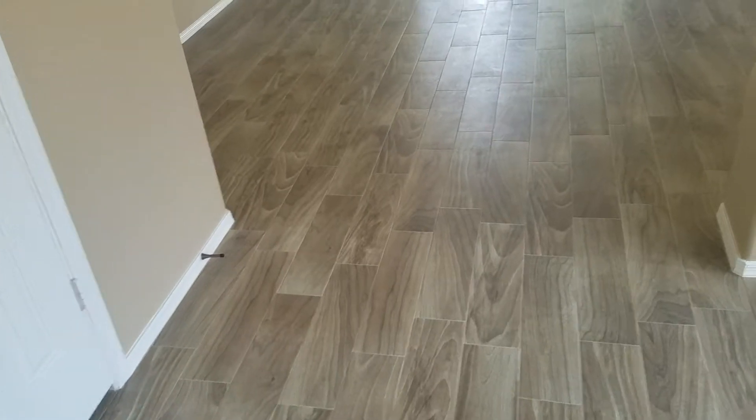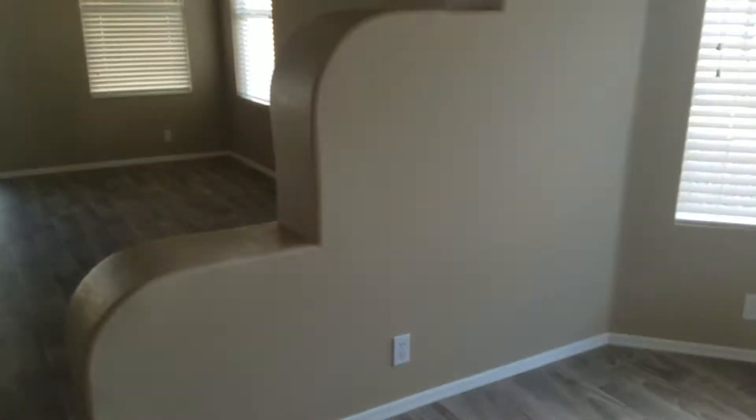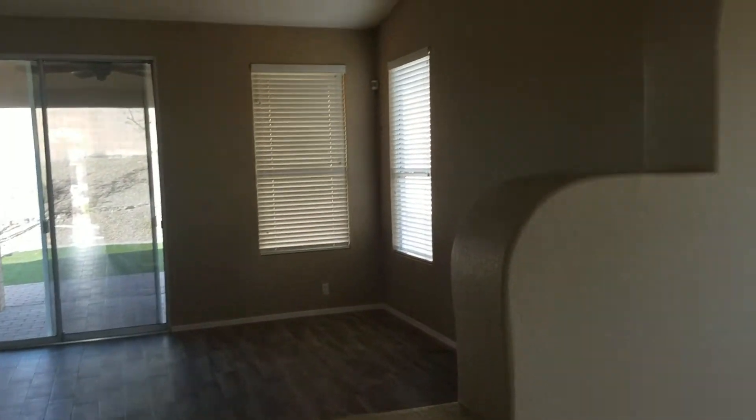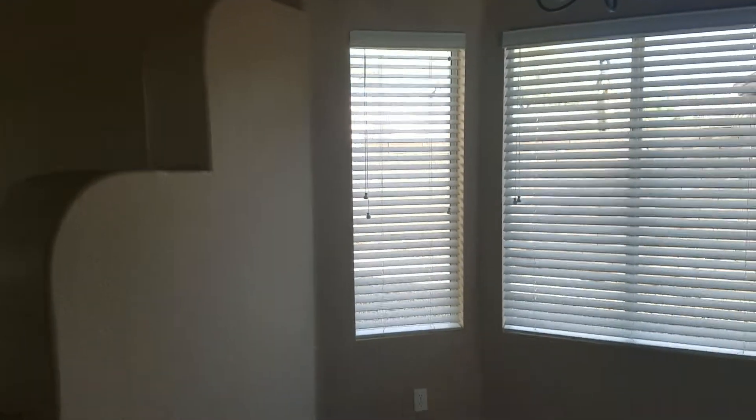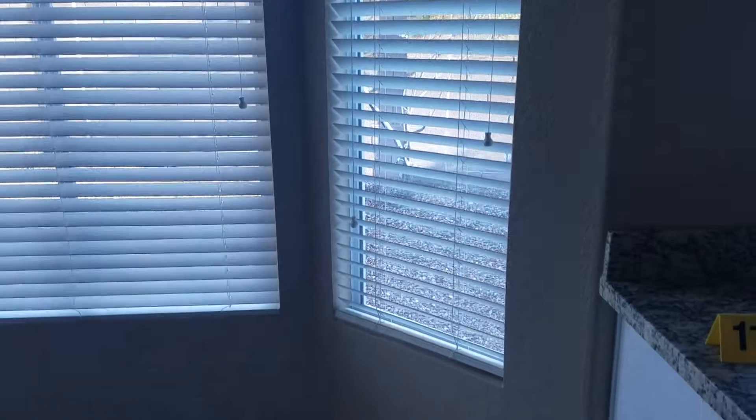Although this tile must be relatively new — I didn't find any heave cracks or breaking of the tile. However, the exterior of this house needs six-inch aluminum seamless rain gutters as recommended, and dirt grading using screened classified topsoil, landscaped away at least three to four feet to remove any excess water. There is also a crack in this drywall at this location, and it continues in the ceiling right there. All of these are indicating settlement — it's a verification.